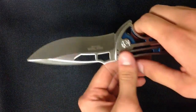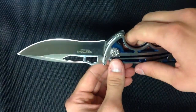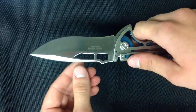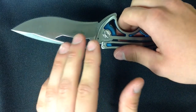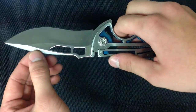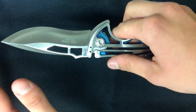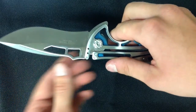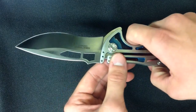Alright guys, so as far as blade finishes, there are just a few, generally speaking, that we'll be looking at today. This one is going to be your polished or your mirror finish blade. Basically, when you highly polish a finish down to the point where you can barely even see the grind marks in it, you're decreasing the friction on it and also making it less porous.